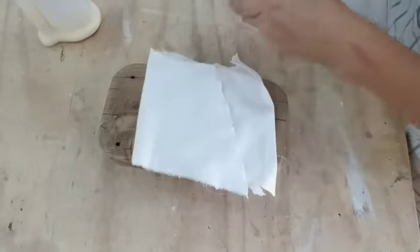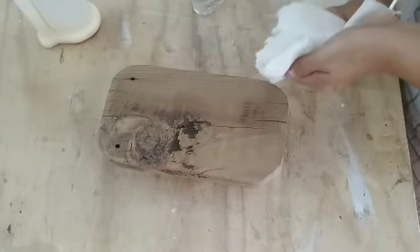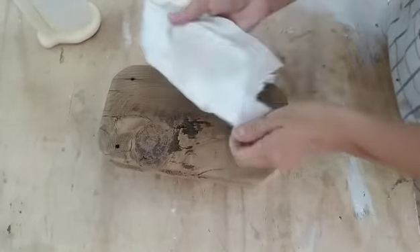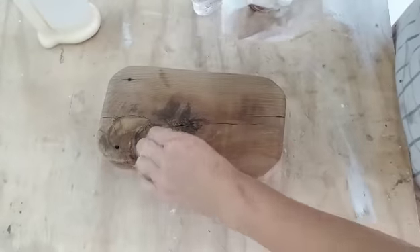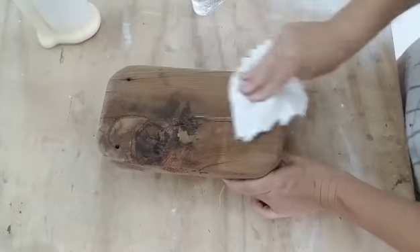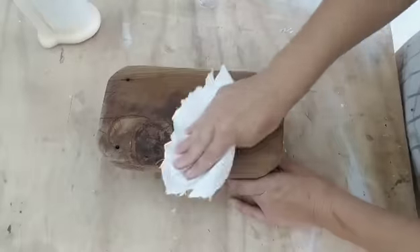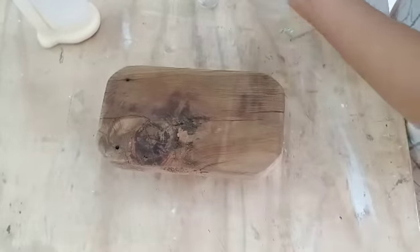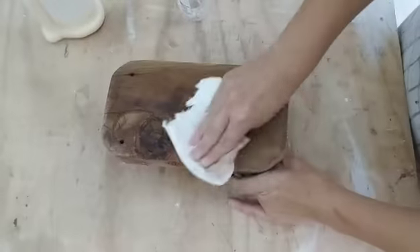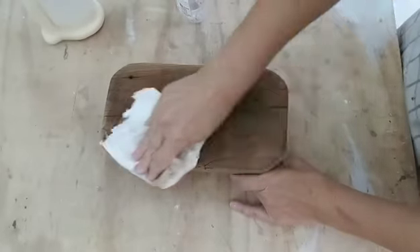The final step is to use cutting board oil — this is a food-safe sealer. I'm just using a piece of fabric and you rub it on top. I just love the way it makes the wood look. It seals it and brings out the grain, but it also keeps that old vintage look that I'm going for. That combined with the rough edges from the grinder — I just absolutely love the way this tray looks, and so do my customers.